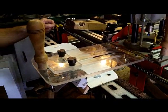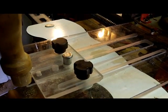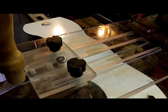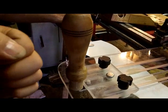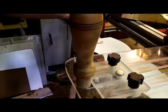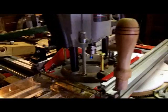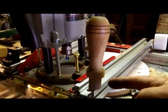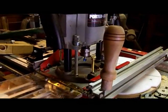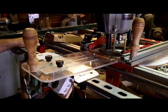Now some of you may remember Curtis' Y-axis template follower that went on the back like a normal legacy would be. He's got the clevis pin that comes up — that's the template follower. He's got the two adjusting knobs. What we're going to add is this handle here, which is where we'll grab and move it in and out — that creates the Y-axis follow. If we want to use the floating technique instead of the drive motor technique, we're going to have that handle screwed directly onto the rails, so we can grab the router and create the X-axis and let it slide across the rails. So this is generation two of the forward following Y-axis template follower.